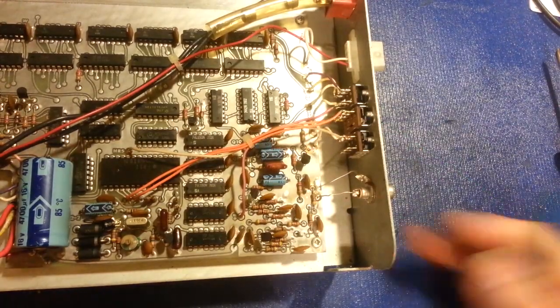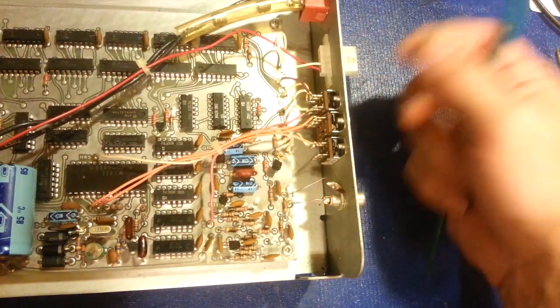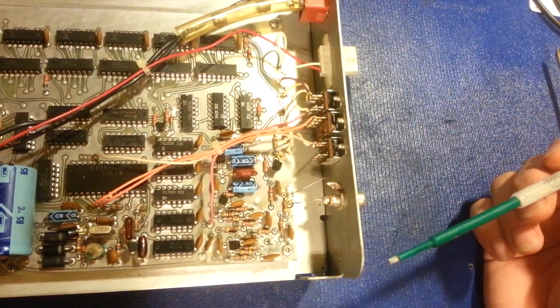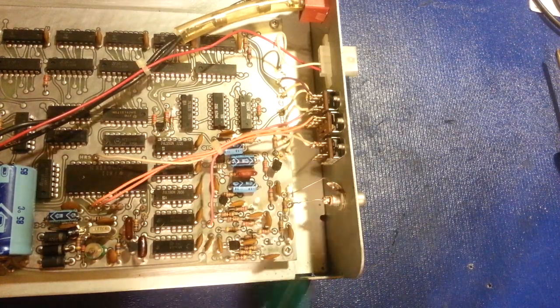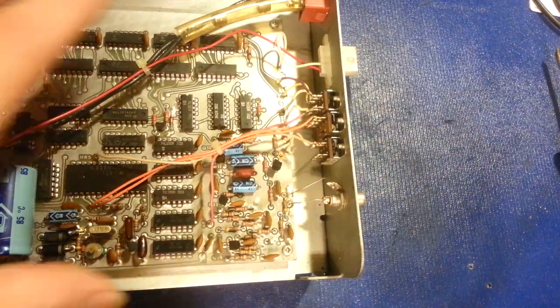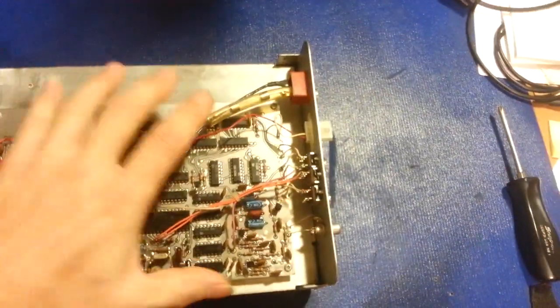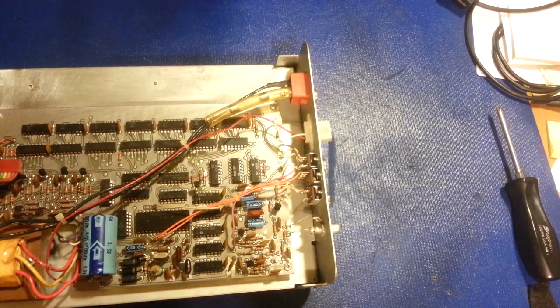So luckily on the back side here there's no decal, so we can get to the screws. Of course, you can see all the screw heads there. It's easy enough just to pop those screws out, push the power connector in, disconnect the RCA jack here, the sample port, and just unsolder the wires off of the AC jack. And then you can get the board up and back just enough to get in there and do what you need to do, and then put it back in.